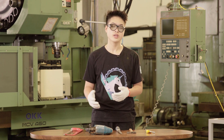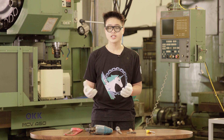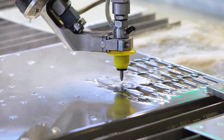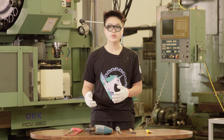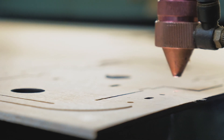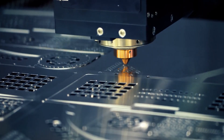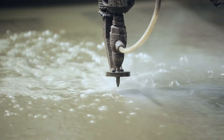Now let's look at the wire cutter, the laser cutter, and the water jet. These are as accurate as you can get, but they are incredibly slow — what you can get done in an hour with the router might take up to half a day with one of these. The wire cutter cannot cut without going through the whole thing, so the cut has to be all the way through and approachable from the side. The laser cutter, while capable of not cutting all the way through, cannot cut very deep since the laser disperses extremely quickly. The water jet, however, has no such limitation — it is one of the only ways to cut heat-sensitive materials, as the water cools down the material heated in the process.